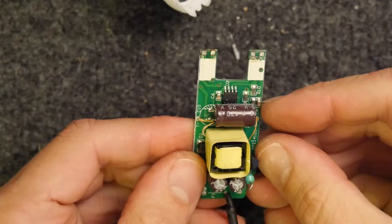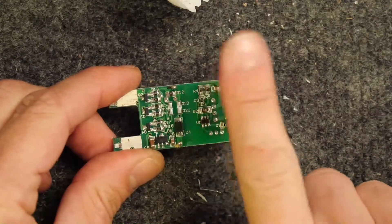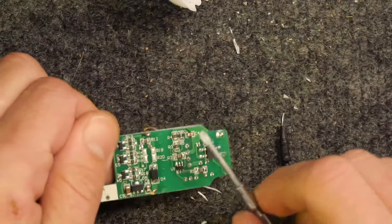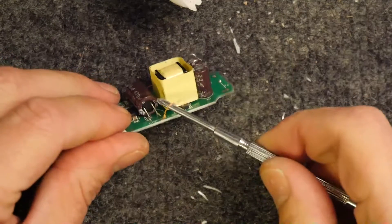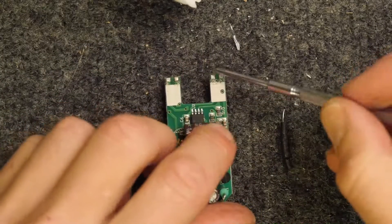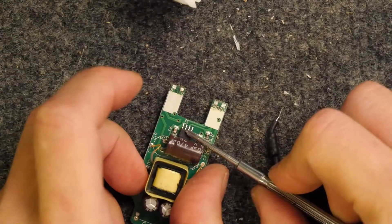Let's look at the power supply first. Good isolation really — it's going through the PCB. There's complete isolation between the mains side and the rest because the power is being transmitted through the transformer over these two tiny wires. You're not going to get an arc jumping that six-to-eight millimetre gap. I guess these almost act like a fuse as well — if you get an issue there, those are going to vaporise themselves. There's some stabilisation circuitry there, and I can see ground, an interrupt line, and VCC positive. I think this power supply is actually operated via the infrared.